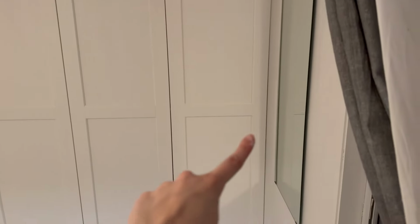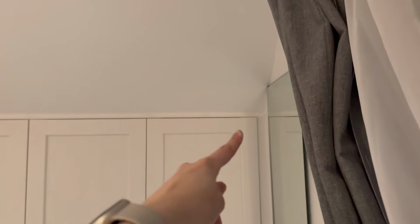I think we need to touch up the paint, but look at how good that looks. So we ended up putting a quarter round at the top. Basically, we realized the two hinges would go into the holes in the cabinet fine. We obviously knew we'd have to drill holes there, but the hinges at the top basically had to be at a certain point, which meant we had to add that quarter round. We put it in with some brad nails and caulked it, and I think it looks good. And then we've got the baseboard running along the bottom.